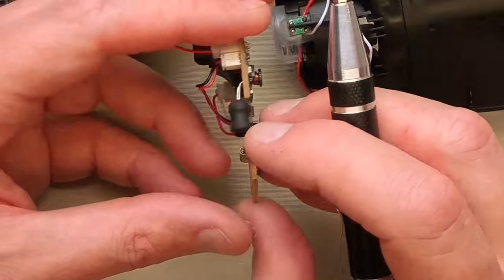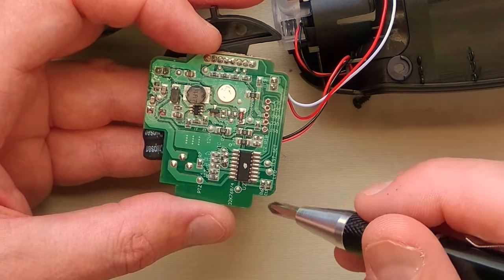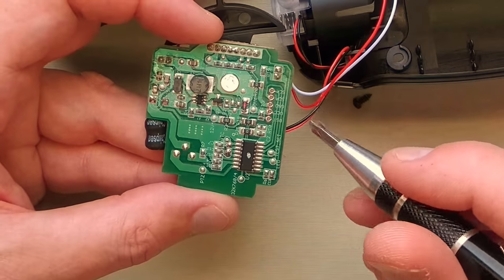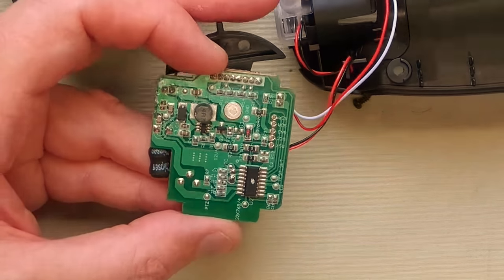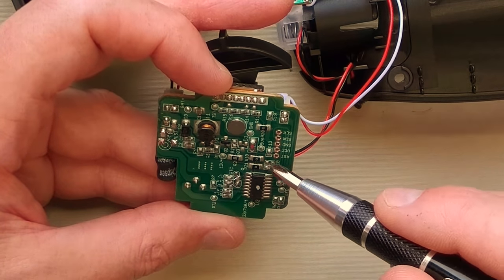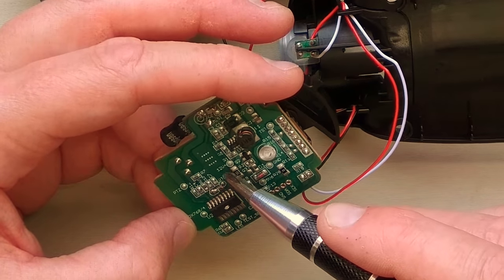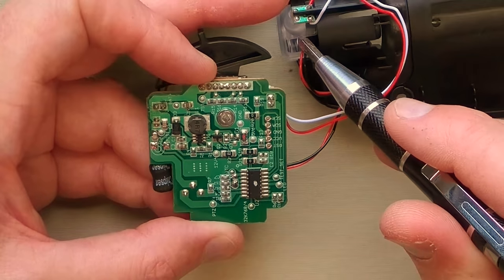The circuitry seems to drive a fairly big transistor on this side with an inductor for the piezoelectric crystal. And the piezoelectric crystal — it's almost as if it might have some sort of feedback, because two of the pins, one via a resistor, are going back to this chip. The circuit seems to be getting a rail which might be 5.6 volts — a soft 5V6 reference. Actually, I've just seen plus 12 volts. That might be a small voltage regulator for the chip, taking it down from a 12-volt rail. It's odd that it's boosting up so high, but the 12 volts may make it easier to generate the ultrasonic energy required in the atomizer.